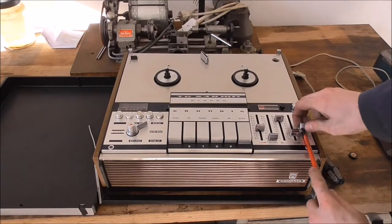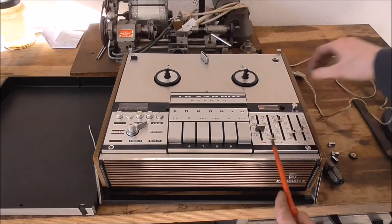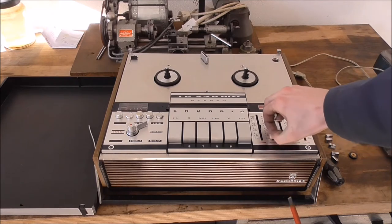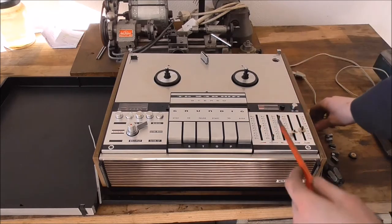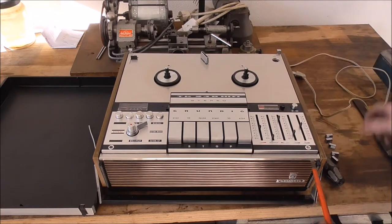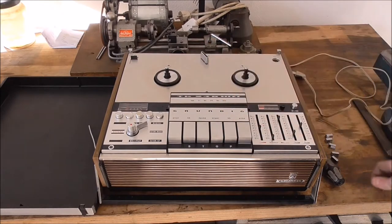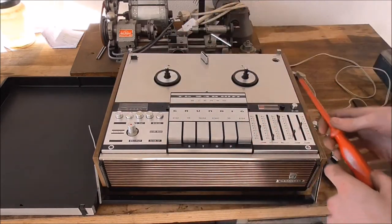This thing isn't able to rewind anymore. I've looked online and it appears to be a certain rubber roller which hardens up over time and therefore isn't grippy enough to carry the weight of the tape. So I bought a new one. There is nothing you can do to recondition the old rubber, so it's quite pricey. I paid 15 euros for it, but it saves me the hassle of having to rewind by hand.